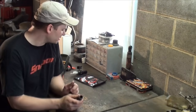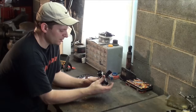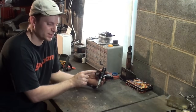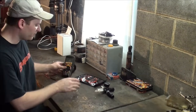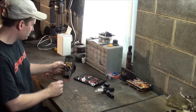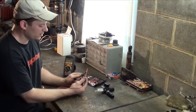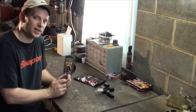What I'm going to do to perform this test — as you can see, I got an air regulator. I'll be taking this pressure switch, screwing it into the air regulator, poking compressed air up to this side of the regulator. This regulator can go anywhere from 0 psi up to 100, but like I mentioned, we only have to go up to 10 at the most. I got my multimeter, I'll be setting this to continuity. So when the contacts close, the circuit will become continuous — there'll be a continuous loop. The contacts will close, the current will flow from one terminal to the other, and you'll hear that audible signal on my multimeter. So let's go ahead and perform this test.